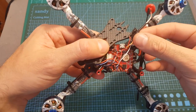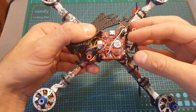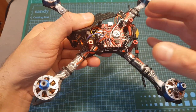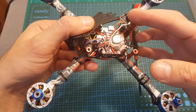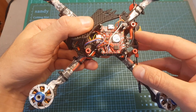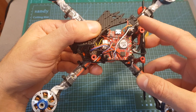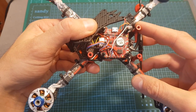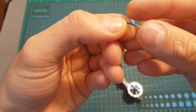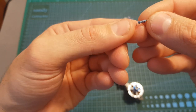When researching this VTX I came across AJ Christensen's video where he shows how to configure it using the smart audio feature on Betaflight. I reached out to him and he kindly sent me a custom version of Omnibus F4 firmware where it's possible to set the VTX using smart audio. The version he sent is not 100% working — you can set the output strength only to 25 and 100 milliwatts — but hopefully they'll figure it out. A link to his channel is in the description. Another suggested solution was to put a 10k resistor between the smart audio pad and ground, but I tried it and unfortunately it didn't work.